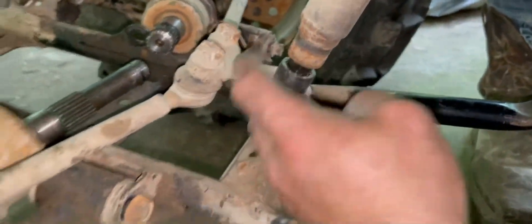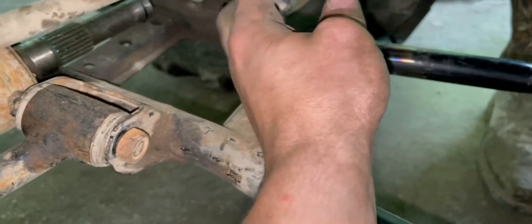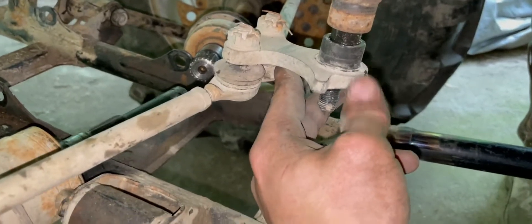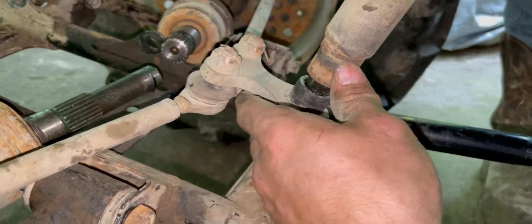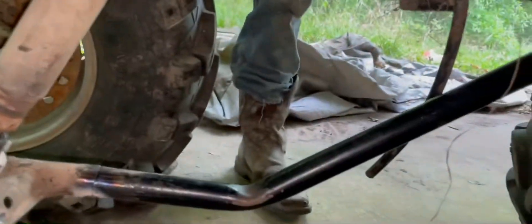So basically, it's going to sit like this. I'm going to cut this shaft shorter, still going to put that bearing in here, mount it about right there with the bearing sitting in between here. Then I'm going to cut this, shorten it 45 degrees with the U-joint. Then I'm going to build a shaft, another 45, to the steering shaft.